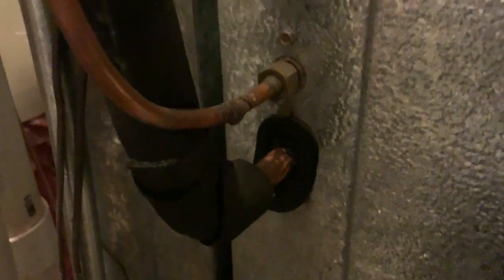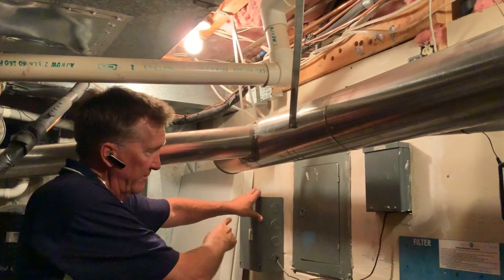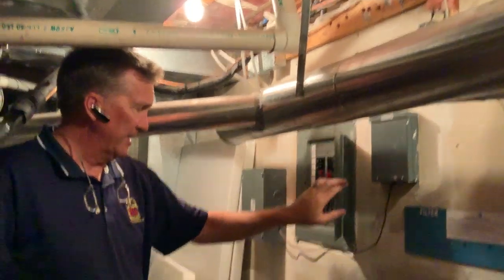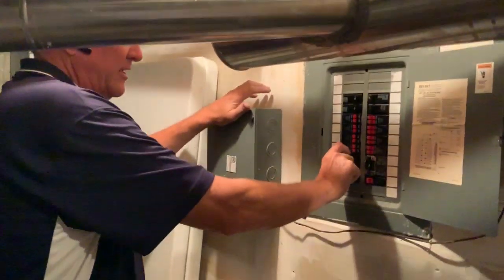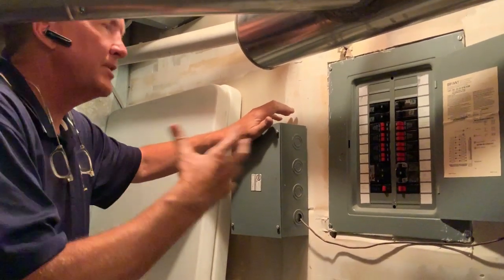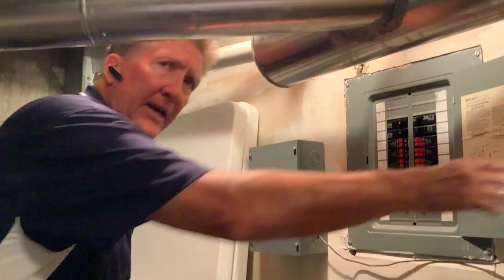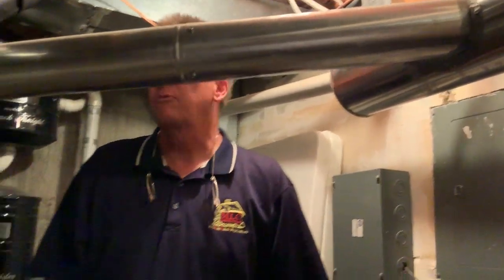Water softener over here — it's time to add salt. You can see how much salt they have in there now. You fill that up to here. It's a very big, tall unit. Over here you have some kind of solenoid switching system, probably for lighting. This panel has a couple things that need repaired inside. Two of the breakers: one has two wires going through it, the other has three wires going to it — double and triple lugged. And yet they have spaces in it still. It doesn't make sense why they did that.